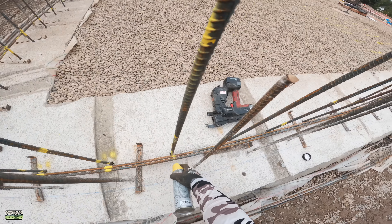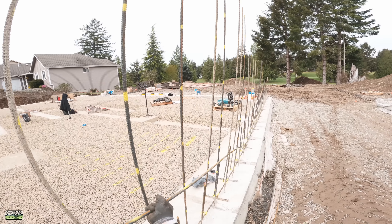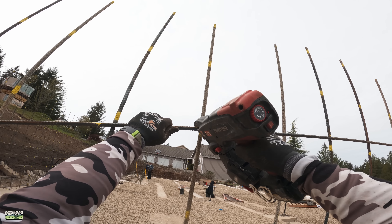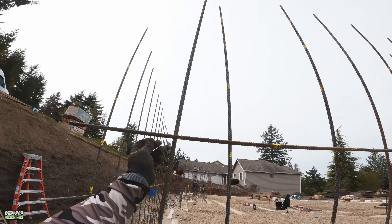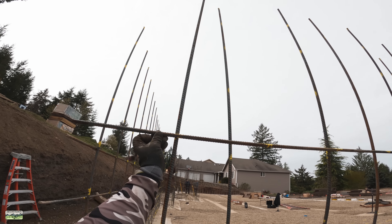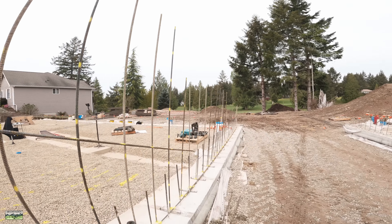Here with the first couple of sticks, I go through and put a dab of paint at each of the verts — that way it's laid out to where the verts actually are. We had already laid those out 12 inches on center. It seems like the easiest way — just line up the yellow. I actually really enjoy this kind of thing. I'm not looking forward to the rest of this project, but this part is kind of fun, only because of the rebar tying tool.